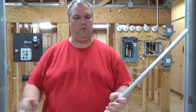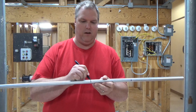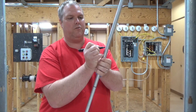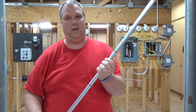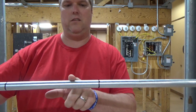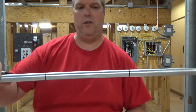I am using a Sharpie — those of you who have had me in class know I always say don't use Sharpie, but we're going to use it for this demonstration so you can see it. So this first mark has my added one inch because I want ten inches here, and then this is going to be my eight inches in between because I'm going to bend 30 degrees.